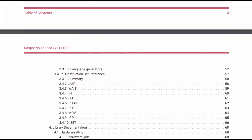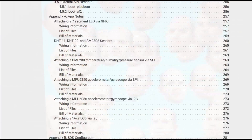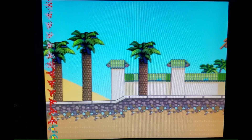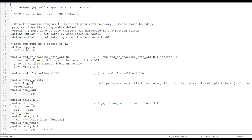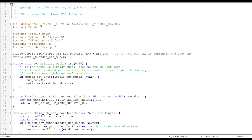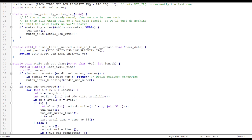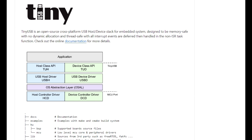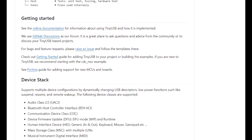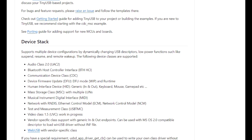As part of his work, he developed the RP2040 video capabilities that I demonstrated in Episode 6 of the PIO Chronicles about two and a half years ago. Graham's port of Doom not only utilizes his VGA video routines for output, but also tinyUSB for keyboard input. Since I'd like to implement the Pico's USB port for input and output in lieu of a UART, I thought that I would try to make Doom work on my Pico.